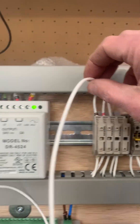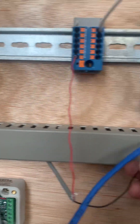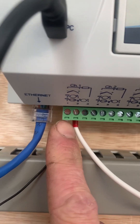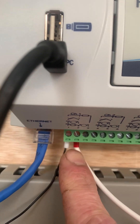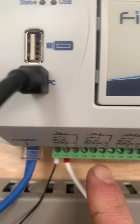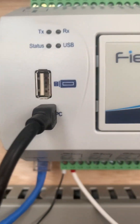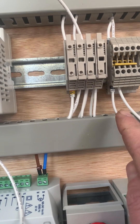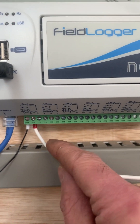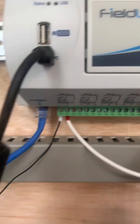It's fed from a fuse off the power supply. If you look at the field logger itself, you've got a red lead from the transmitter coming back to pick up 24V, and the black lead is coming into terminal one on the field logger. For each sensor you're only occupying two terminals per channel, so the next one would be terminal two. We've also got our zero volt — at the moment we've got one connected, but once they're all connected you'd loop zero volts across into each one in turn.